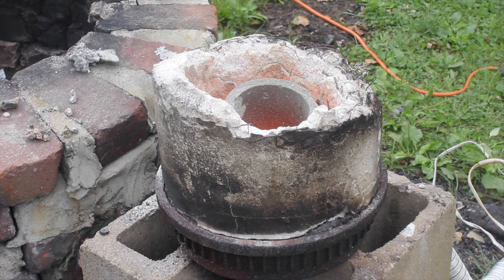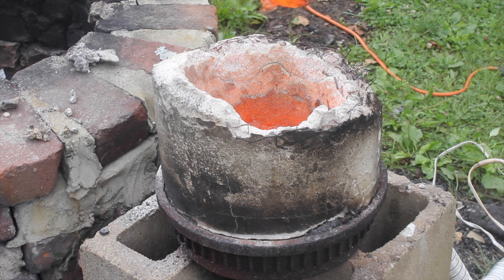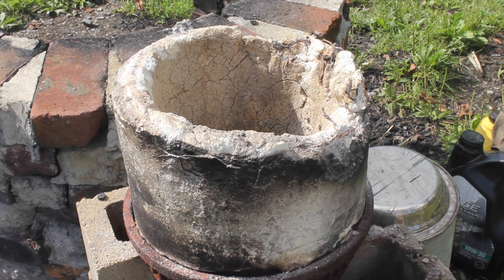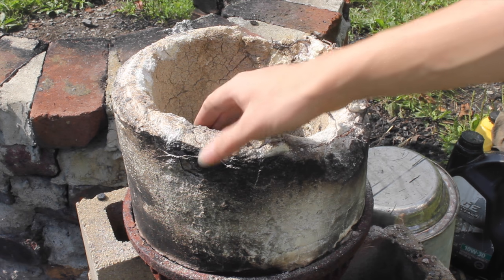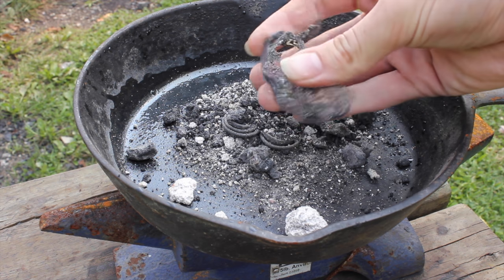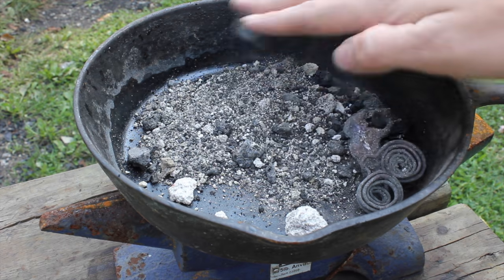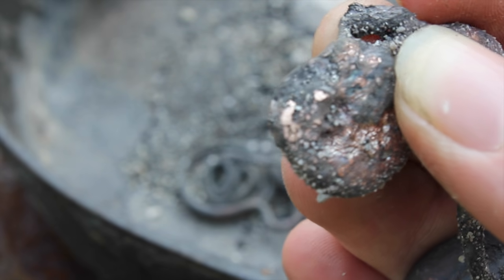Eventually, I ran out of fuel and had to shut down the foundry. I couldn't tell if there was any liquid copper in the crucible because a lot of ash and coke had fallen in. You may have noticed that throughout the video, the lid of the foundry becomes more and more tilted. This is because the sand and plaster wall around the foundry is beginning to disintegrate because of the heat. The next day, when I emptied the crucible, I found that there was a piece of copper that had melted. It must have been right at the melting temperature of copper because one of the copper pieces hadn't melted at all. The rest is just ashes and unburned coke that was in the crucible. I used a file to remove the copper oxide coating from the piece, and you can see that this certainly is copper metal.